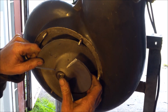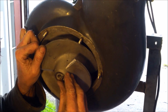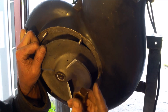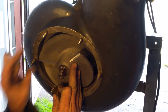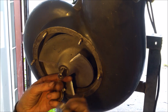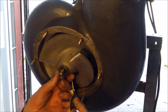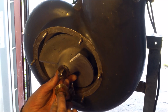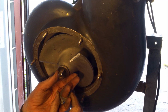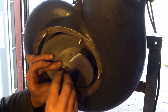Okay. That's in. Push the keyway. You can help it push it a little bit with the nut, especially when you are on the river. And then the spare shims, I'm gonna put them here. I put now the torsional damper, so the little cup and the rubber washer with the rubber on top. I then put the lock washer, and then I put the shaft nut.